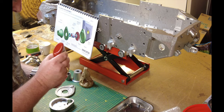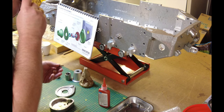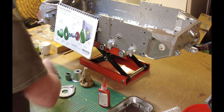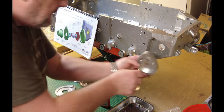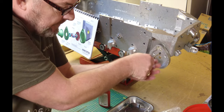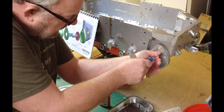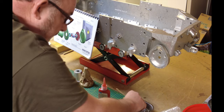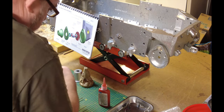I'll thread lock up. I'm just going to push the first one in — make sure I've got the right tool. That one is going to go in that hole there. Now I don't tighten these off yet, I'm just going to put them on fairly loosely. I want to keep this fairly loose for now until I offer the bushing in behind it.